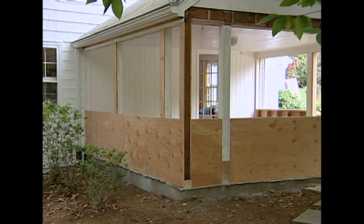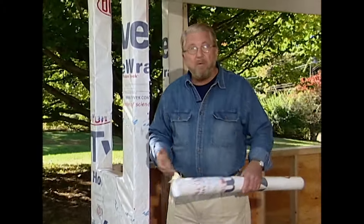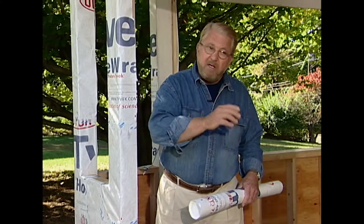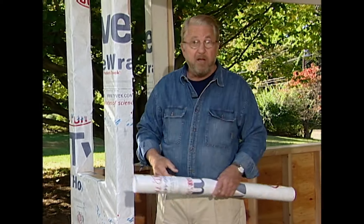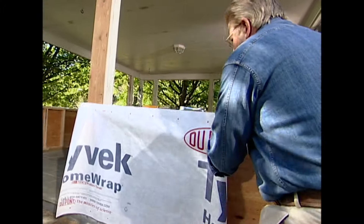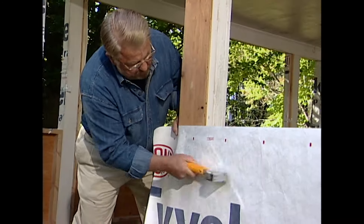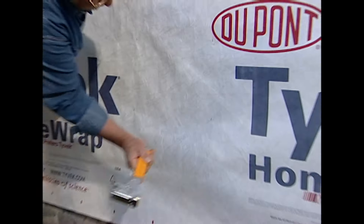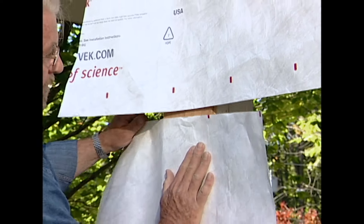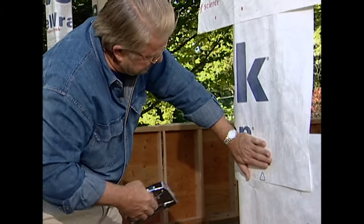Now it's time to make sure my handiwork can resist Mother Nature's attempts to shorten its useful life. This is a water and air barrier. I want to keep water, rain, and cold winds from penetrating to the inside of the house, while at the same time allowing water vapor to pass through the walls to the outside and not get trapped inside the wall where it could do some damage. This material can be attached either with a conventional staple gun or a hammer tacker — the hammer tacker is a good bit faster and less tiring on the grip. Upper pieces are lapped over lower ones so that flowing water will always be diverted to the front of the strip below and never directed behind the wrap.